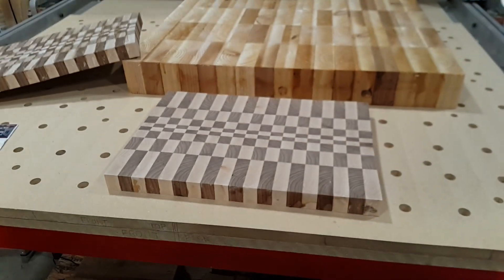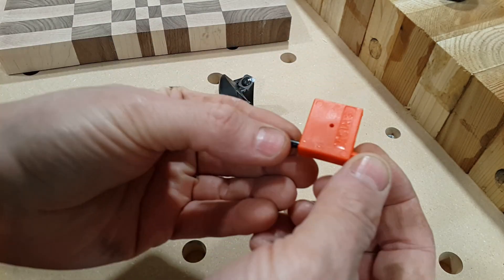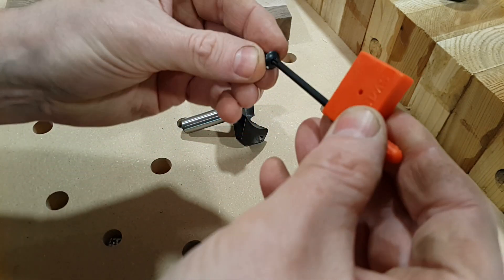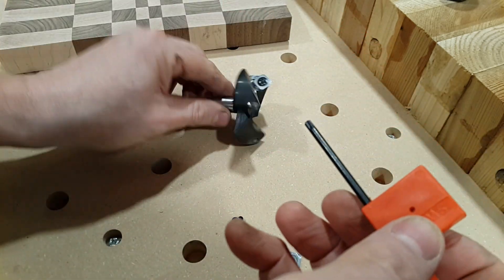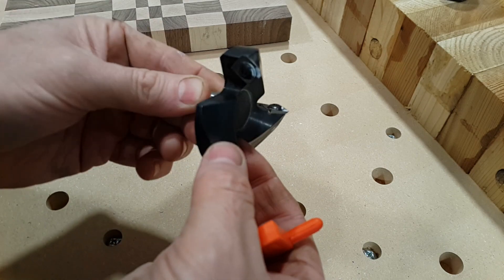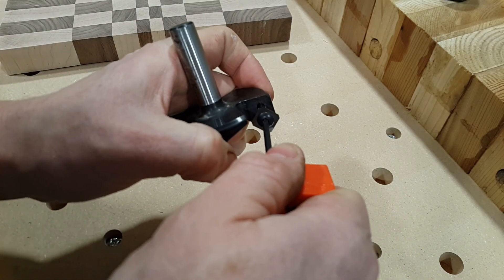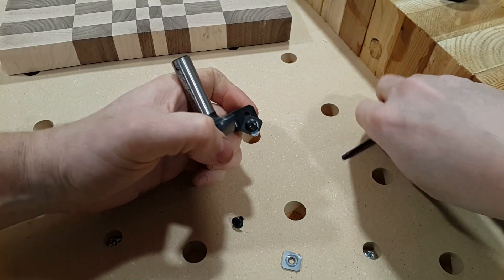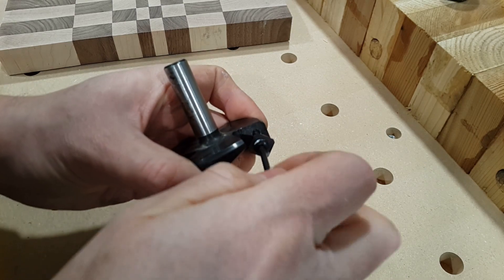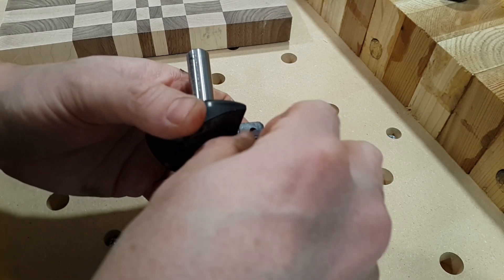They give you this tool to take the knives off — I assume it's partly for convenience but mostly to limit the torque you can put on the nut. It's a Torx bit. I've marked the knives — the points that are down — so I'll know on reassembly if I want to reuse the same knife or move on to a new face. There's a decidedly sharp point at which they loosen. They do publish a torque spec, but other than this tool I have no means of getting it back to that spec.